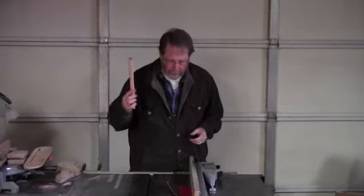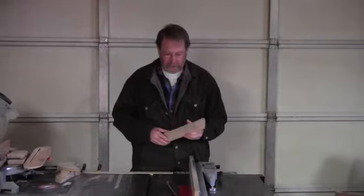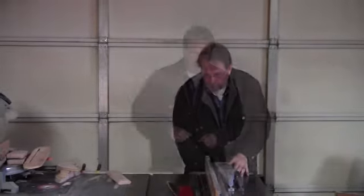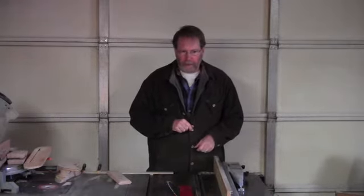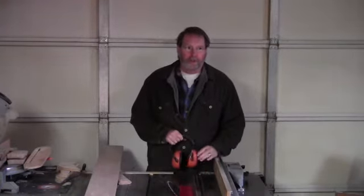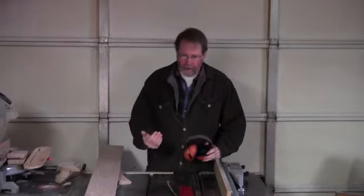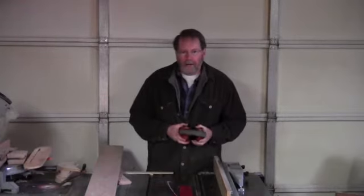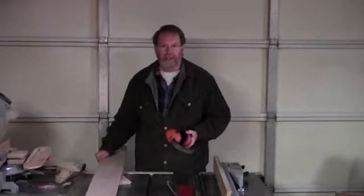I've already cut a sample piece and verified that it does match the existing molding. I've gone ahead and have my saw tilted up at a 45-degree angle. I have the oak here — we're going to make our first cut and then start laying things out. One of the challenges of working in Studio G here is that the placement of the saw gives me maximum space; however, to cut longer boards — say more than two or three feet — I have to open the outside door.